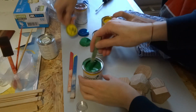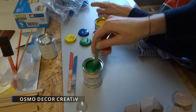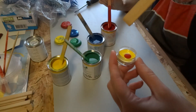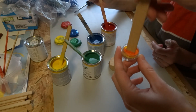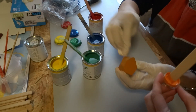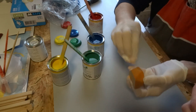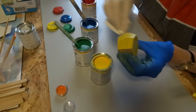Now it's time to give another set of blocks a nice touch of color. I'm doing this with Osmo Decor Creative — it's a hard wax oil and it's food safe. As you can see you can mix colors together. With the help of my mom I applied two coats of each color. When you apply one coat you need to let it sit for 20 minutes and then you can wipe off the excess. The next day you can apply a second coat.